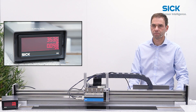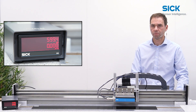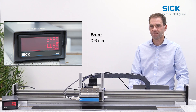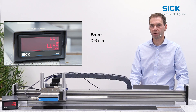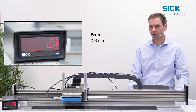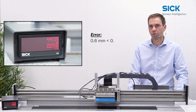Now we do the same measurement with our internal reference material at 0.05 meters per second. We achieve 0.6 millimeters offset. The sensor moves back at 0.05 meters per second and ends up at 0.2 millimeters. The error is higher than before on this material as it is more challenging, but still the error is below 0.1 percent.